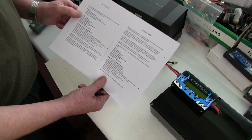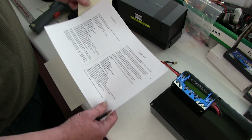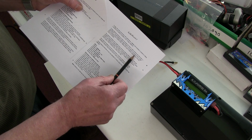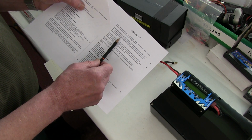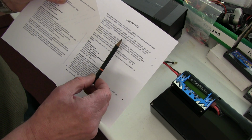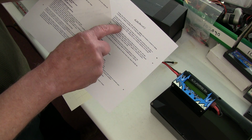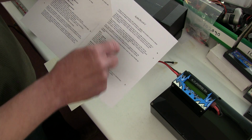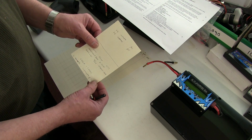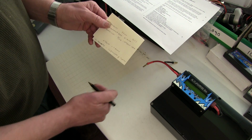Well, there's a lot of blurb on their website about their batteries and graphene, and they talk about, if you look up their spec, using a single layer of graphene 0.335 nanometers thick. It's written on their website. And it makes the type of battery substrate the thinnest known to mankind. Well, you might not know this, but I'll tell you, 0.335 nanometers is actually the minimum thickness of a graphene sheet, and it is actually 1 atom thick of graphite.